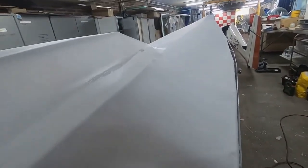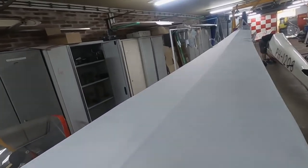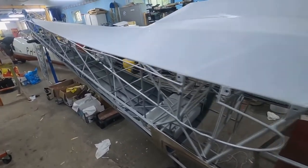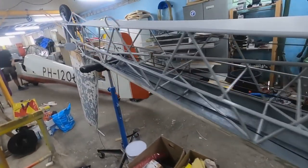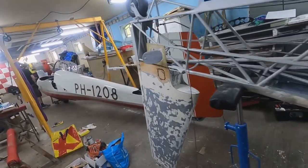After a lot more shrinking with the hot air blower, we end up with this nicely tightened fabric on the bottom of the airplane. However, there are a few areas that we want to reinforce, and of course we still need to cover the sides. There are still a few more processing steps on this fabric as well, but we can only do that once all the other fabric has been applied to the fuselage. We will continue with that in the next episode.